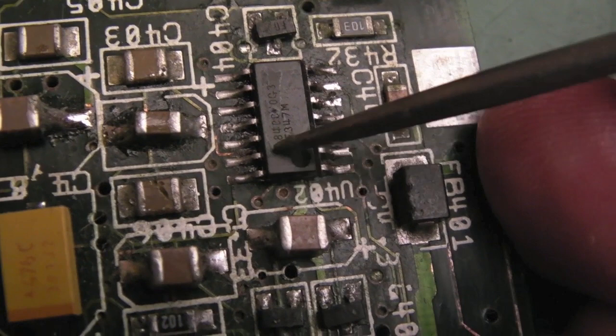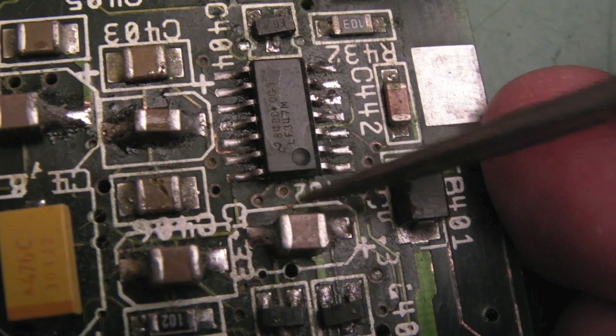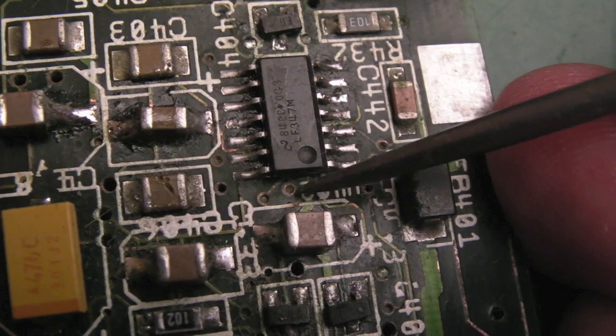The connection here that was a low resistance, not quite short to the minus 12, it comes up here. So this is soldered on the other side. There's a blob of solder on the other side of that via. So if I solder this one as well, hopefully we'll get... I mean, there is a dead short between the two, but hopefully that might fix it. We might need to remove this, but I'll reflow this anyway.